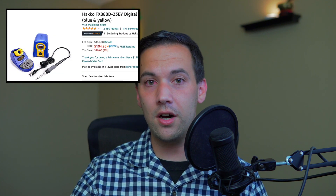In the long run, this ends up being a much cheaper option. This soldering iron was about $100. Plus, I got some solder and a soldering braid. Here's my solder — this is rosin core solder, and it has lead in it. Based off of everything I read, you want to avoid the lead-free stuff because it tends to be a little bit more difficult to work with. The only thing you want to be careful with is once you're done soldering, wash your hands really well before eating or doing anything else where your hands are going to get close to your mouth. I also got a de-soldering braid. This is going to be what takes the solder off the component before you replace it with a new one and add the new solder. Both of those things are about $10 each.